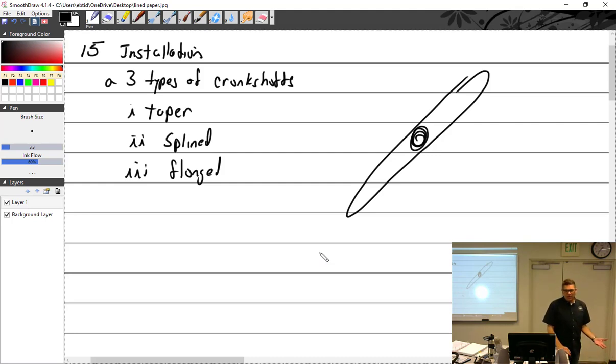But anyway, the Taylorcraft does have an A65. You do hand prop that, but look how it's set up. It's a tail dragger. It comes up. The hub is about right here on that thing. So it's really tall, right? And so it makes sense the way it rotates around to have it in that position. Now you would think that's top dead center, but you would think you'd want the compression right about here, right? But that doesn't work because then it starts to get compression in here. So it makes perfect sense on an airplane that is set up correctly. Probably the reason why they're that way started with because you had to hand prop it that way. And then from there, it just became the standard, and that's the way they're set up.